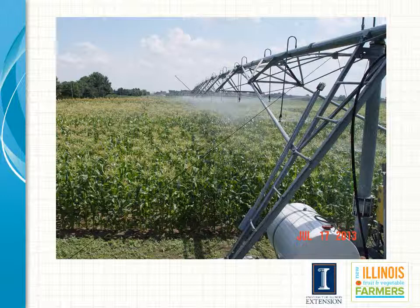This is a self-driven linear irrigation system, and so instead of going around in a circle like a center pivot, this one just goes straight across the field. This type of system is expensive but highly accurate. Since water comes out of suspended boom-type nozzles, light wind is not a major problem with coverage. The linear system works excellent on sweet corn and snap beans. It is time consuming to move between fields. In some cases these rigs can be towed, in other cases they remain in one field throughout the entire growing season.